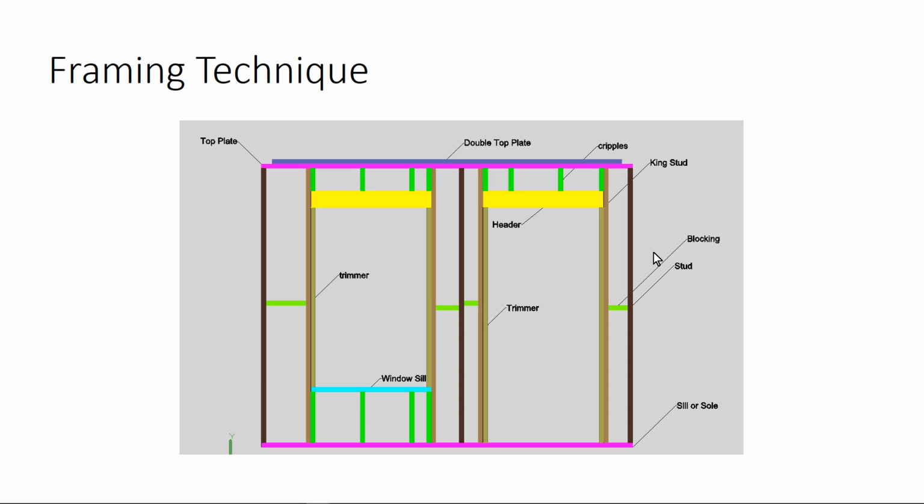The main benefit of 24-inch centered wall stud mounting, besides cost, is that the walls gain a greater R value, or heat resistance value. Some homes are built using 2x6 lumber, or the actual measurement of those timbers would be 1.5 inches by 5.5 inches. But those studs are mounted at 24 inches on center to take advantage of the increase in R value while shoring up the sturdiness of the wall with the thicker lumber.